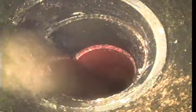Okay, so here's the county cleanout. This is the county cleanout right here, coming in at the top of the pipe, or city cleanout, whichever one. And see that pool of water down there, and that transition to the red clay pipe. That clay pipe is going to be the city or the county part of the lateral, but they've got an offset over here. You can see it where these pipes join, they're offset. Pretty bad. So keep going until we get to the main.